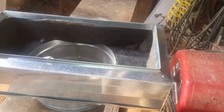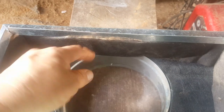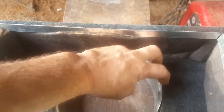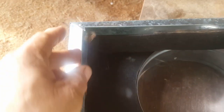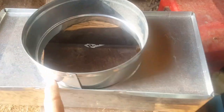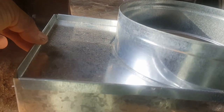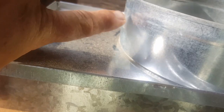This air duct sealant is how we turn boxes like this from a negative pressure box into a high pressure box. It's generally at the end of the air system with the register in front, but we convert it so the air goes the other way. You have to be aware that air can leak around all the corners, so we coated all the insulation with foil tape, wrapped it all the way around to the ductwork, and everywhere we saw a leak we ran about half a container of sealant inside of there.